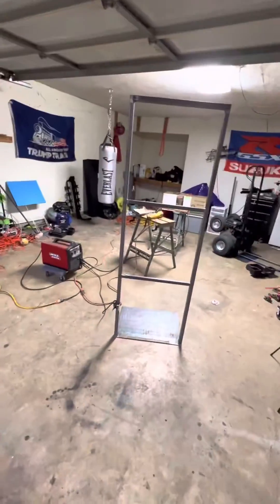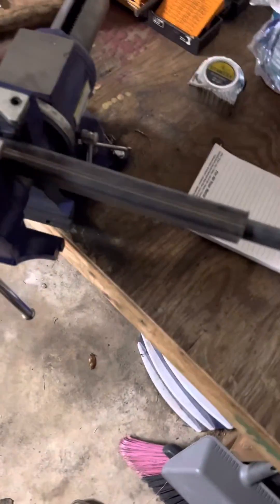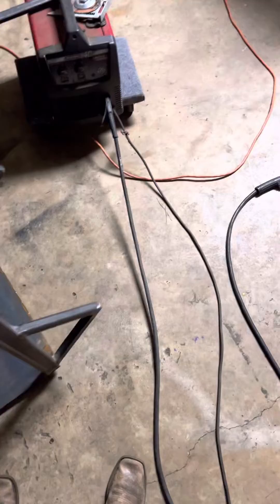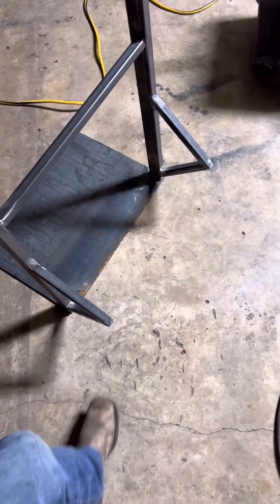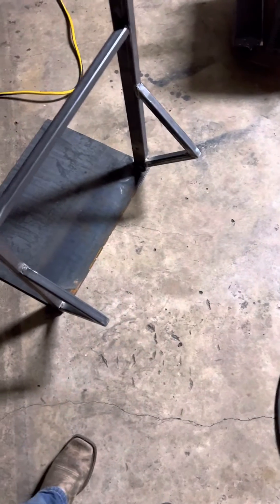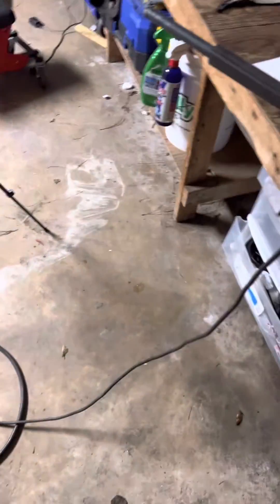Just talking about where I'm gonna put the handles — at about the 18 inch base plate here. I have built the axles, laying the axles out before I weld them. This axle is 11 gauge square tubing and three-quarter inch smooth rod. I'm gonna weld the tubing on right there, but it has three-quarter inch rod on the inside to hold the tires.